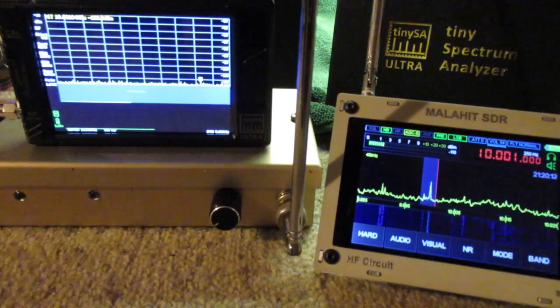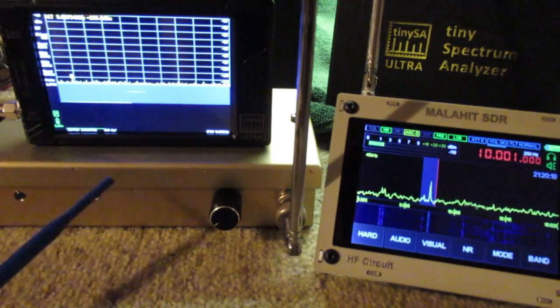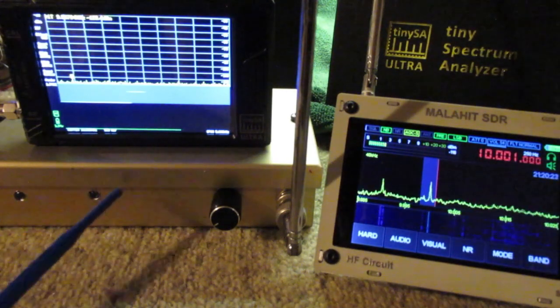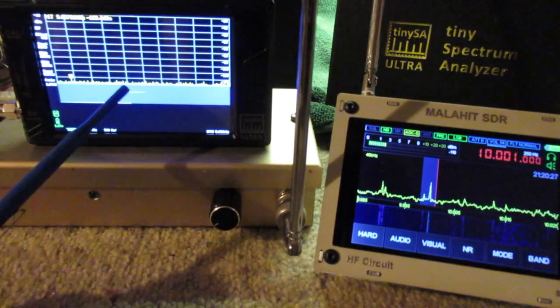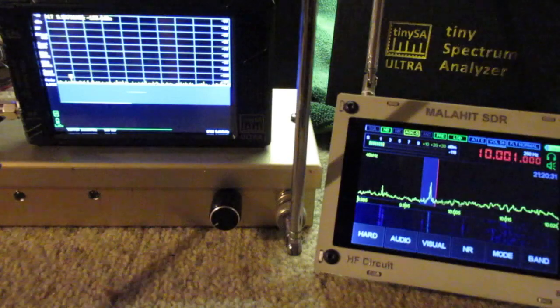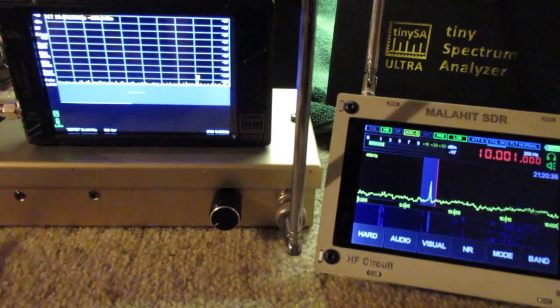In this video we'll try and show you how to put the tinySA Ultra on frequency with the menu. To do that, I've got my home-built GPSDO. You'll see its unlocked state, and then the locked state later on. You can also watch it on the waterfall displays of the two receivers and see how it initially drifts and then what happens when it's locked on frequency.